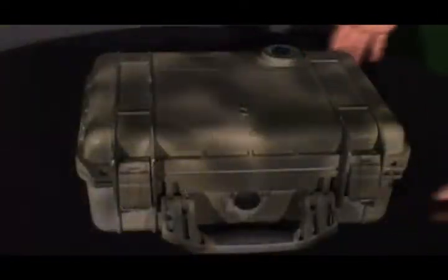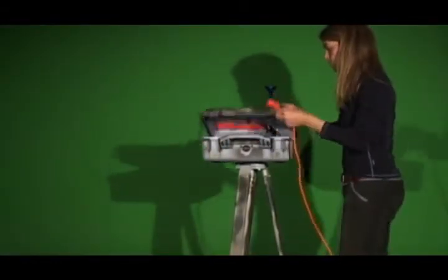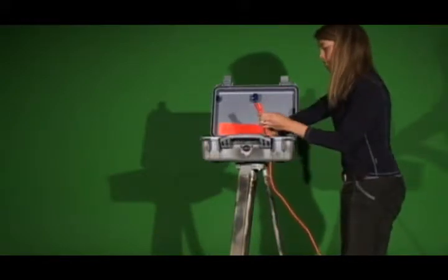If you want to use an extension cord with your enclosure and Dust Track, make sure there is a hole drilled in the bottom of the enclosure. Instead of putting a battery in the enclosure, connect the supplied Dust Track power cord to the Dust Track and coil the cord up in the enclosure box.